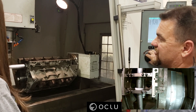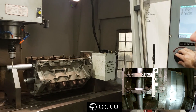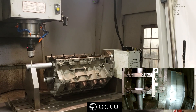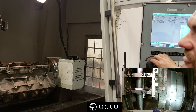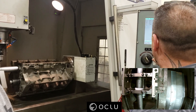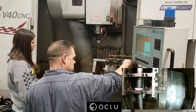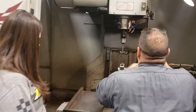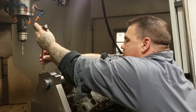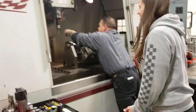We're at ten ten-thousandths of an inch — four decimal places. So we're going to turn the light off, click it on — see right there — off, on. That's ten ten-thousandths of an inch. We're going to Z it, and now the machine knows that's Z zero. We're going to bring our end cap over and screw this down.